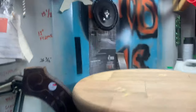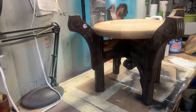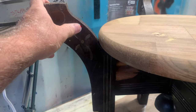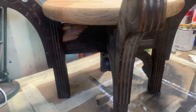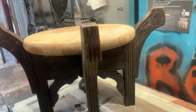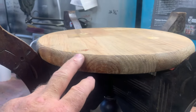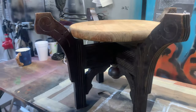I'm not going to put you through the grueling process of watching me do all these steps — I'm just going to explain what I'm doing and show you after the fact. This is going to be cleaned and wiped down real good, lightly sanded to get rid of stickers, then I'll start the process of the Elmer's glue and white paint for a nice crackle finish. The top I'll paint either black or dark brown and do the same process.